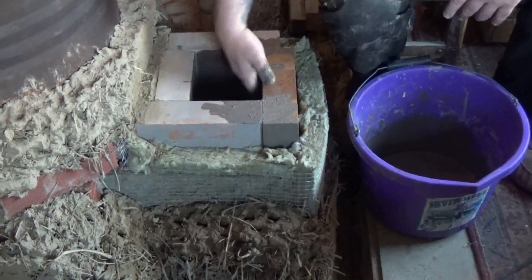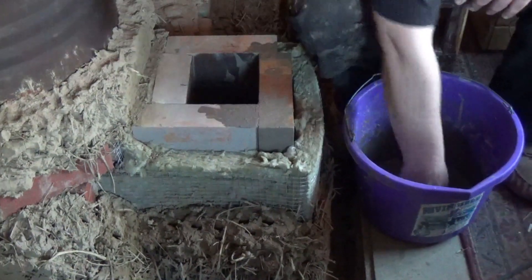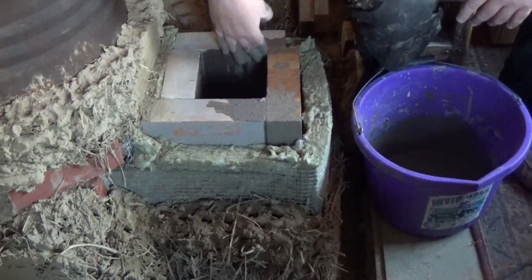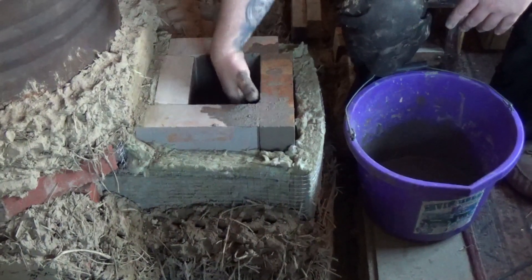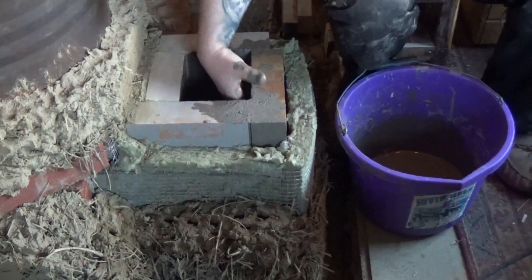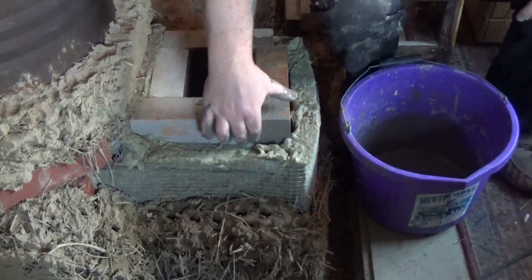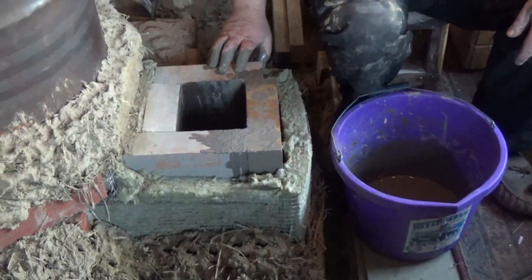And that's it - it's repaired. I'll take a bit of this and work it into the joints just to act as a bit of sealant, and I'll scrape off the excess once it's dried off. And I'll get a bit of the slightly thicker stuff and use that as a kind of grout, just where all the joints are. This hasn't required me calling out any sort of engineer - nobody's got to be CORGI registered. You can just do it yourself, in your own time, at your own pace, for pennies. And that's it. That's sealed in really nicely. That's that fire brick reset. That's that repair done.